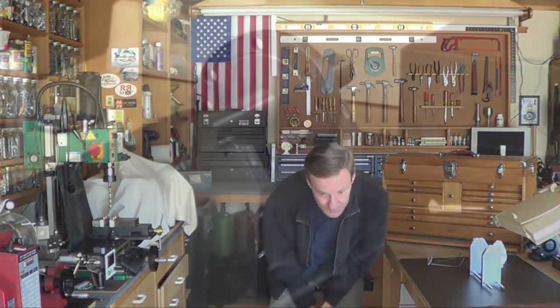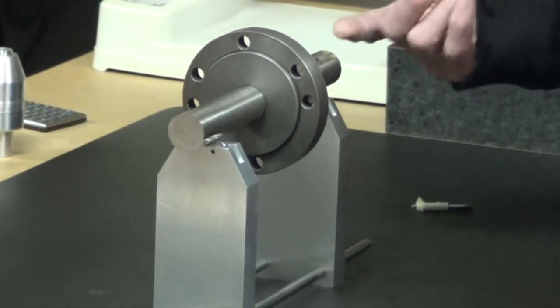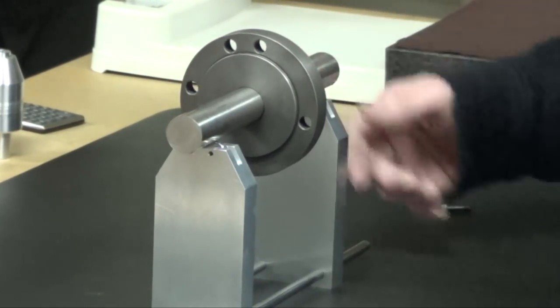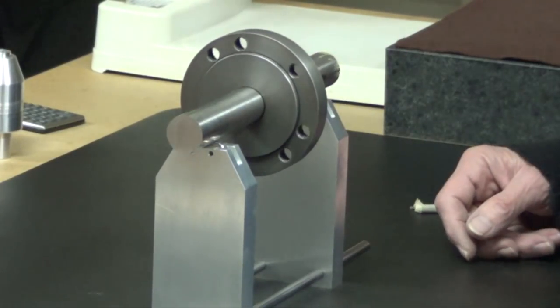But first, I did show in a video a while back that the hole pattern on the adapter plate is a hole where a bunch of metal is missing, so it's going to be out of balance. You have to make a plug for it. I do have the print for the plug up on the website, but here's the adapter plate by itself. Alright, first I'm checking the balance on the adapter plate. I happen to have a 1-inch piece of stainless here to go in here, but you can see as is off the shelf, it's way out of balance.